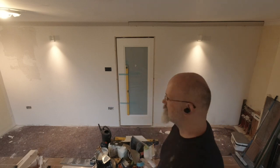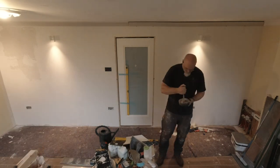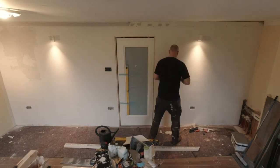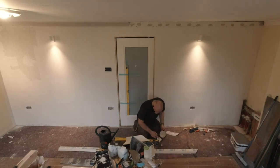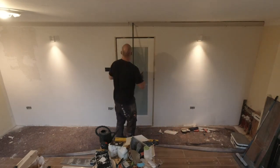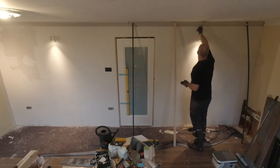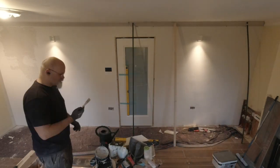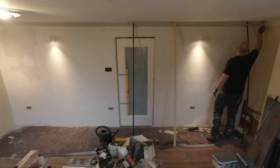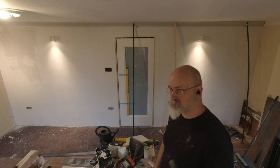I installed the first piece of coving earlier today, and one is left. There are screws in the wall that will hold the coving close to its installation position, which really helps with not having to balance the whole thing the entire time. Adhesive is spread along the back of the coving where it touches the wall and ceiling, and some adhesive is applied to the wall as well. Then brace it all with poles or studs or whatever is at hand and leave the whole mess to dry. The nominal drying time is about 3 to 4 hours.